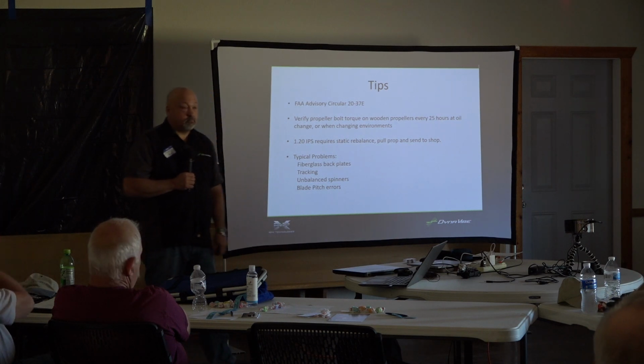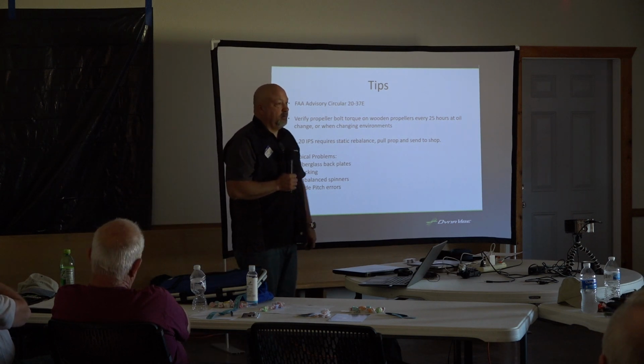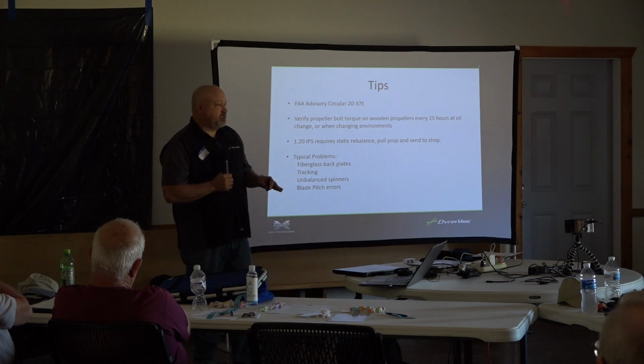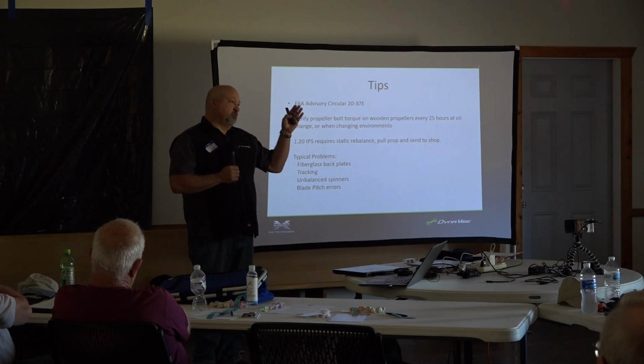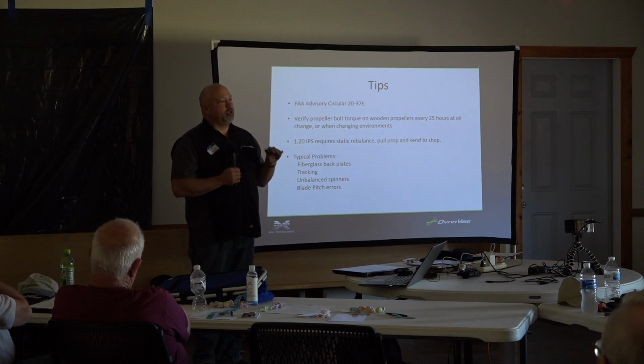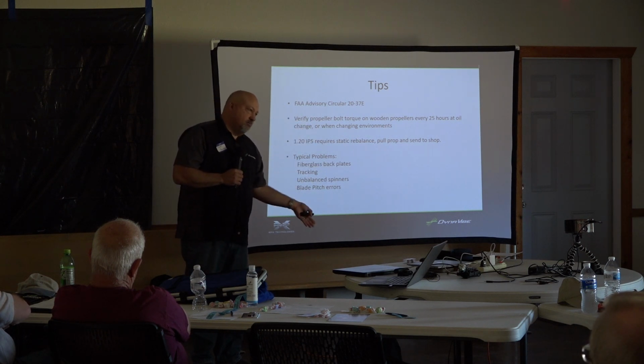Have you seen the deals that bolt on behind the propeller that are like a hydraulic ring? What are your thoughts on those? So I think if you have a really bad vibration, let's say you're up at 1 IPS and you want to take it to a 0.5, maybe that's an option. Most of the people we work with, like Voodoo, Reno Racers, they really want to dial it in. So the way those systems work is you have to have a vibration for the mercury or the liquid to know where to go, right? So it's never going to get you down to 0.